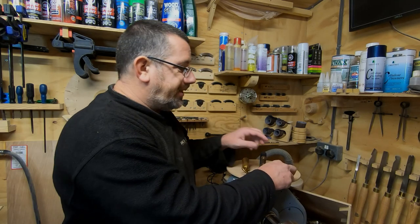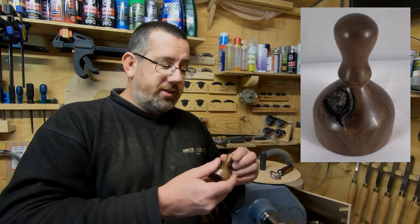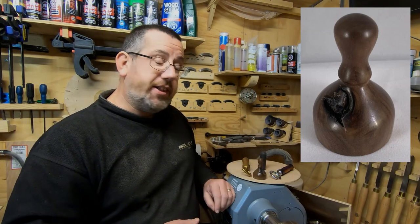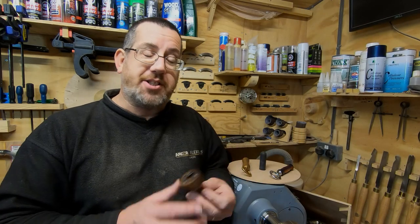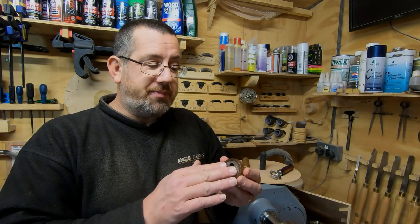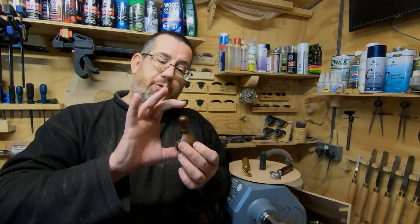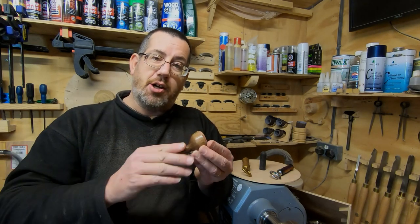The last one I did, this is the ring type one. And the good thing about this is that you can really make some nice nifty little shapes. So that looks like some form of a bell. Nobody would ever realise that that's a bottle opener. The only thing you've got to do with this though is that because you've got your leverage point there, you need some form of length on here so that you've got that leverage to open your bottle with.